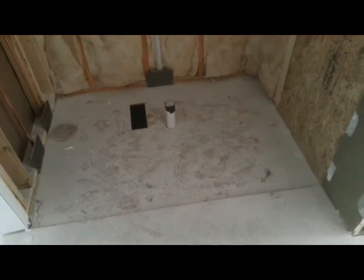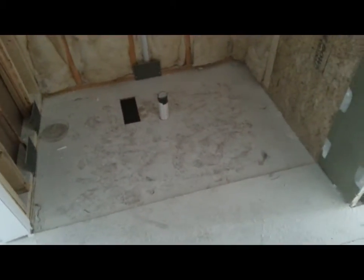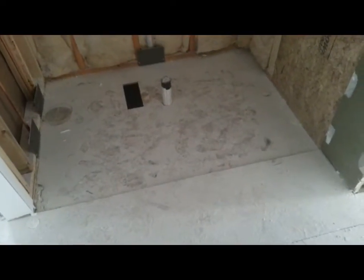Today we're going to work on a project where we're doing a bathroom renovation — you can see all the sheet rock is in and the plumbing rough-in is done. We're going to put the board down on the floor today, but the customer has requested a roll-in curbless shower. So we're going to take this plywood subfloor out, replace it with TI Pro Board, pour a thin pan in there, and then the Schluter will extend from the shower floor all the way out into the room.